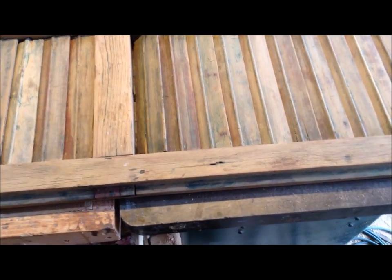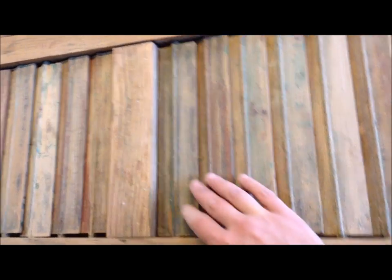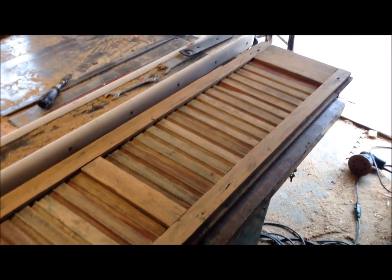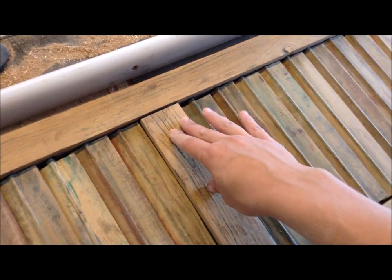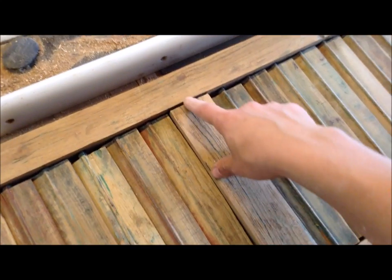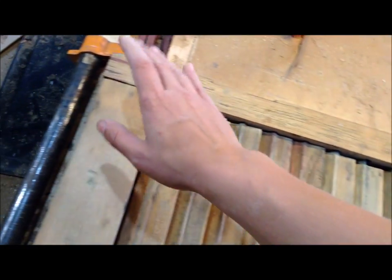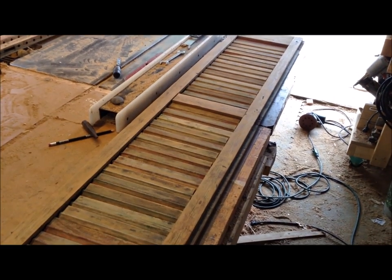I ended up making that a little bit easier - underneath these shutters is a quarter inch piece of plywood, and that keeps all of this level while you're lining everything up. With a series of clamps it wasn't too bad. What I'm going to do to both sets is glue one side of the tenons into place so that when I'm putting everything together, these will at least be square and solid and can't pop out. I'm going to have one side already ready to go and then I could glue both of these together.